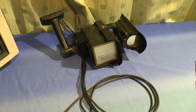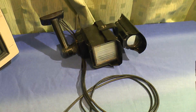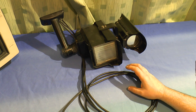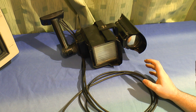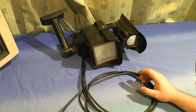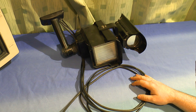Greetings. Looks like Big Brother isn't watching us quite so closely tonight. This is what appears to be a Derwent Reg car number plate reading camera. It's not actually an ANPR camera. What it is is basically a standard camera with a standard video output, but it's designed to see in infrared - an infrared illuminator and a special infrared camera designed to best pick up car number plates, which you wouldn't normally be able to see as clearly with a normal CCTV camera.